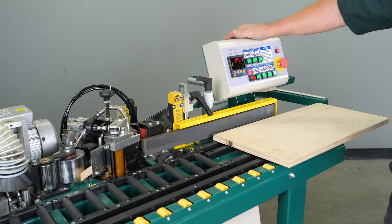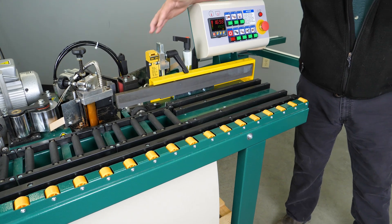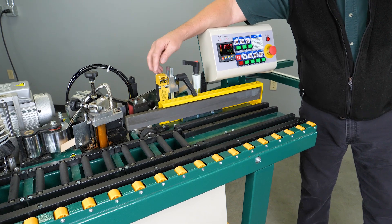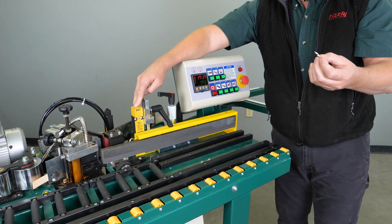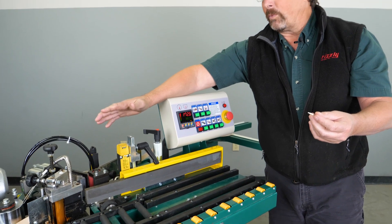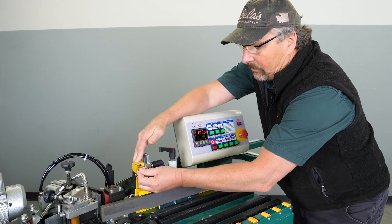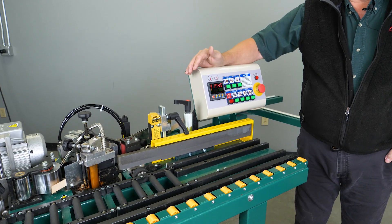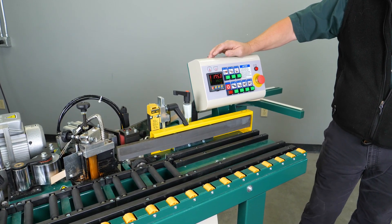We've removed the cover assembly at this point for illustration purposes only. I currently have both switches in bypass mode — I've removed the striker off of the panel feeder. As I pull that off, you hear the pressure switch release, which means none of the other operating motors will run until this switch is satisfied. As I put it back into place, you hear that click, meaning the pressure switch assembly is now satisfied. Once we hit 180 degrees, the spindle assembly will come on and all motor functions will be ready to run.